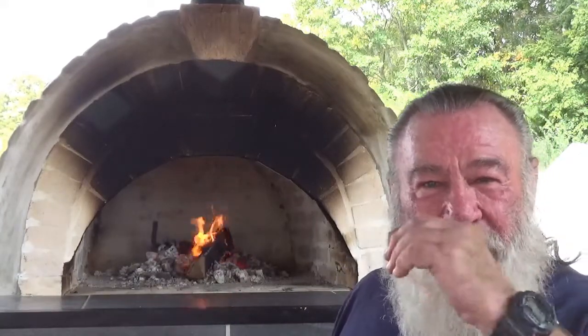The old lady tried to point out, oh, look at that crack. No, that's where I shot the mortar in there and pushed it in, and it dried too fast. It's not that kind of crack. It's a typical mortar crack where your mortar was too dry or too wet, or dried too fast. And in the back, that's where the sun hits it. That's the only place the sun hits this thing during the day, so it would have a tendency to dry faster than mortar anywhere else, okay?